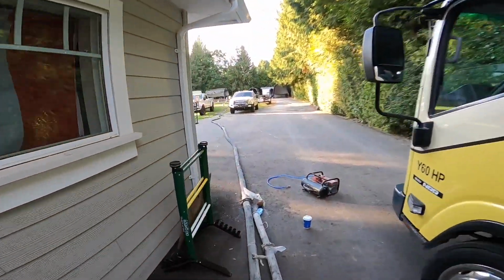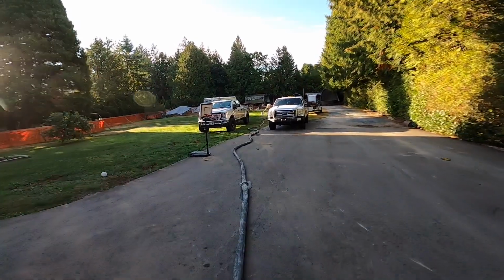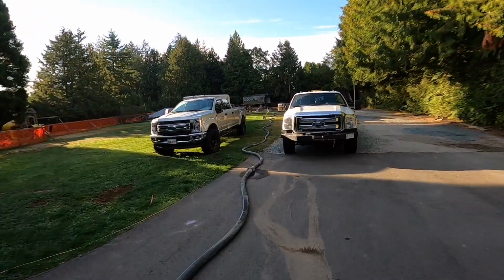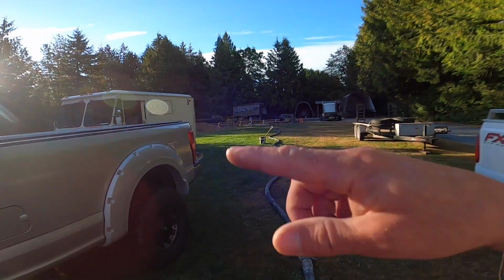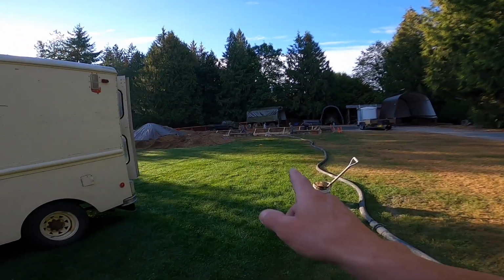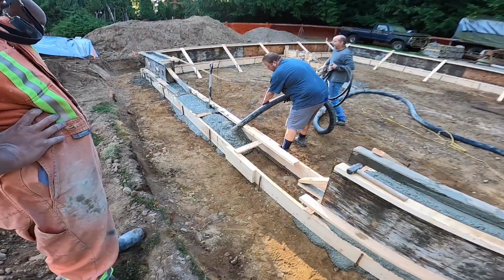So that's a nice slump there. That's probably actually about a 170. So maybe a little wetter than what I would recommend, just considering the mix is a little bit rocky, but it'll be fine. So what we're gonna see here, we'll get this little short wall done. We'll get about halfway through the footing, and then you're gonna see the wet stuff come out the end of the hose. About halfway along the footing here. I'll check back in when that happens. The wet stuff, perfect blowout slump.